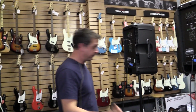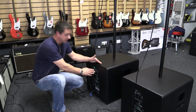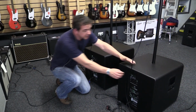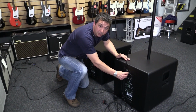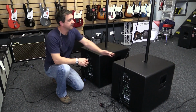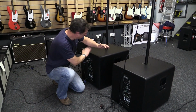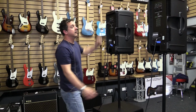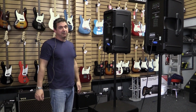One critical thing to remember is whatever volume control you've got this set at, so if you do end up with this being at 12 o'clock, make sure this is at 12 o'clock. If it's not, if this is nearly all the way down, you're going to say, this speaker's working great, and this one's hardly working. You've got to get everything equal, balance it correctly. That's halfway, that's halfway. If you do that, you're sorted, and that'll be a really, really good sound system.